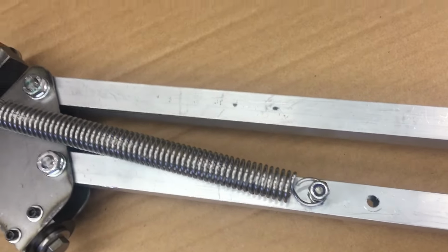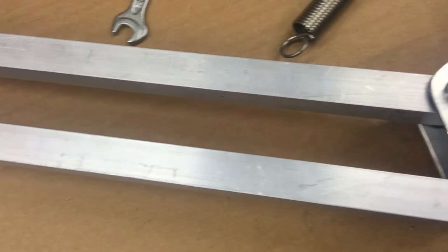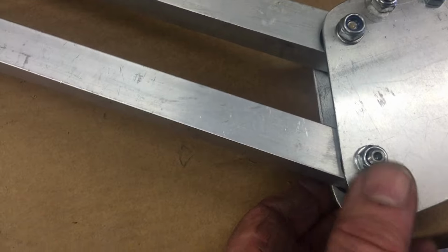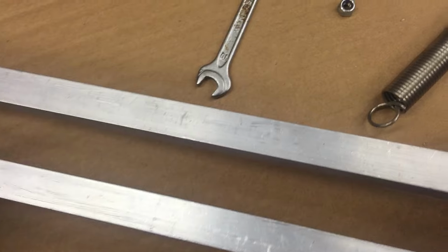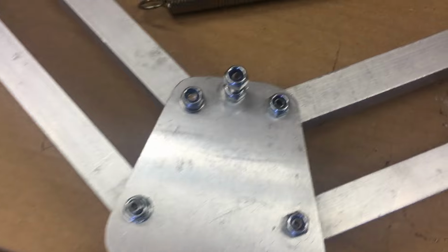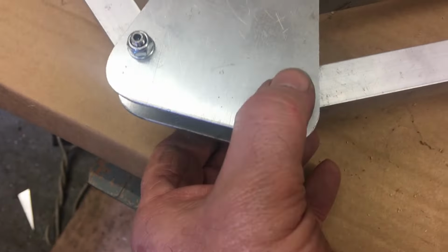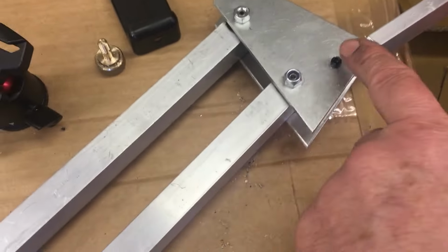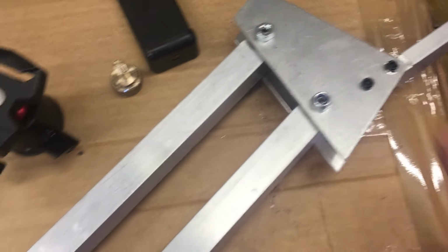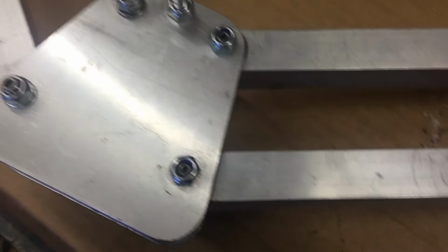I say it's 19mm or 20mm aluminium bar. Sorry, aluminium tube. Each end I've actually put an insert in which is made of Delrin. Drilled through, and drilled through. The end bar again is 4mm, and it's drilled to take 1/4 inch Whitworth.